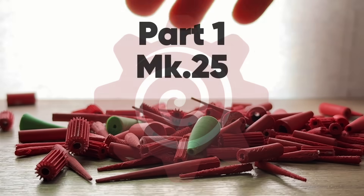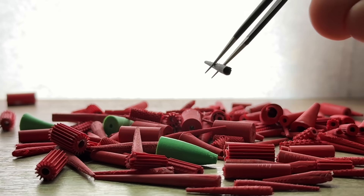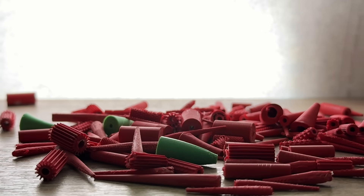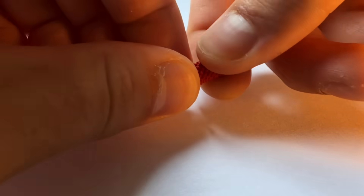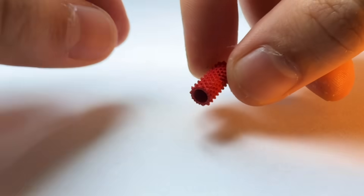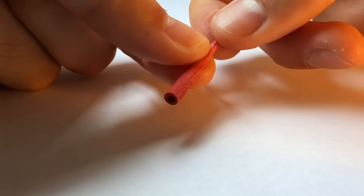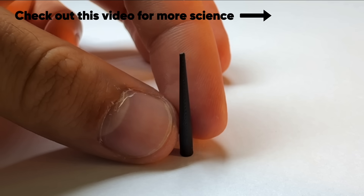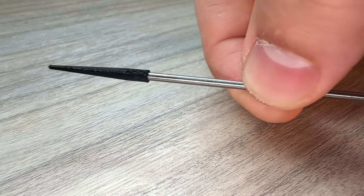Now let's get back to spinning tops. In the last video we put a lot of effort into optimizing the grip for starting speed, and it's time we implemented our findings. To summarize, we discovered that although large knurled grips transmit more torque, thin grips can start the top the fastest, albeit with more difficulty. And in the end, we found that a tapered grip like this has the best compromise. So that's the grip sorted.